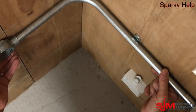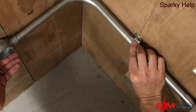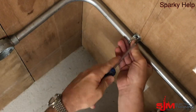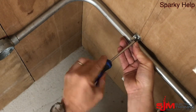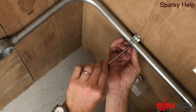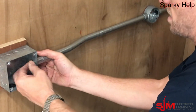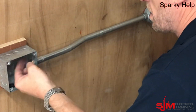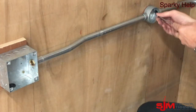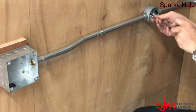Put our first piece in, up against there again. Put our coupler in, put the bush in, put the saddle on, fix it all in location. You don't have to do this like this — you could just pull a bend and cut all those to suit rather than try to pull to bend measurements all the time. Make sure it all fits and it's not like a guitar string — if you took it all off it's all going to spring back out of place, or the box is being warped and distorted to make sure it fits. Just make sure it all fits as you go along.